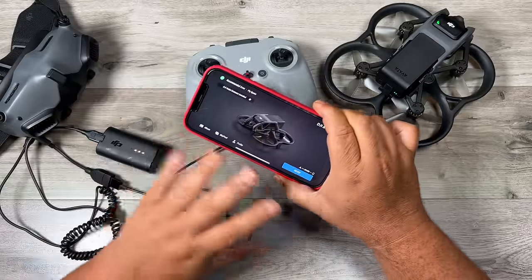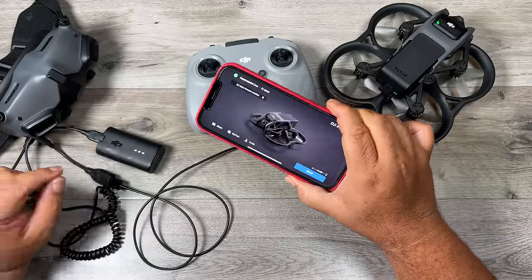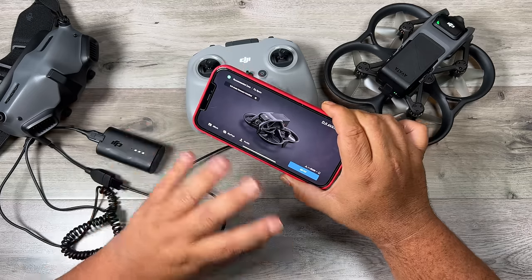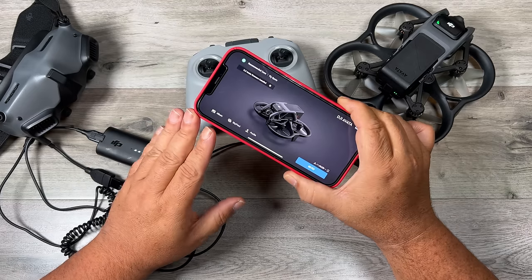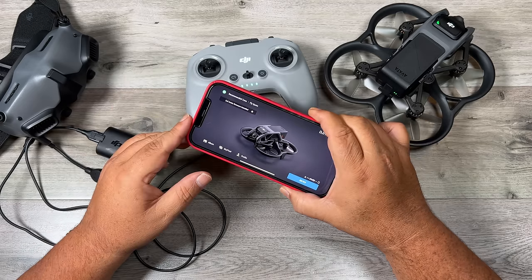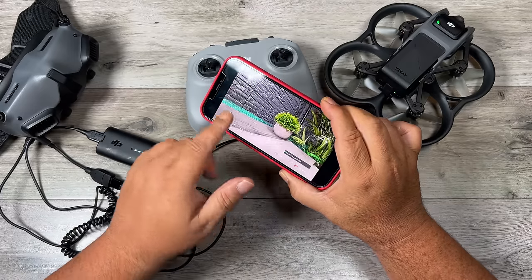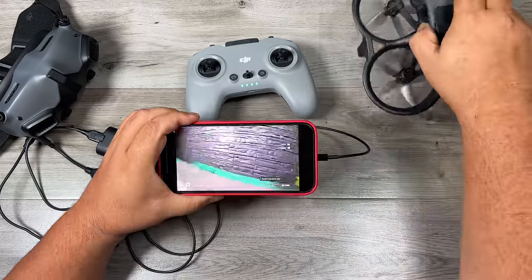You don't have to actually have your phone connected to update spare batteries. If you forget and go out in the field to fly, you'll get the message in the goggles that the drone battery needs to be updated. You don't have to be connected to Wi-Fi because that information is already stored within the system. Lastly, while I have the phone connected, I want to show you another feature — connecting your phone to the goggles not only downloads and updates firmware, we can actually use this as an external monitor. If you're flying and have a friend with you who wants to see what you're seeing, you can hit the Go Fly option and get a preview of what's coming from the drone.